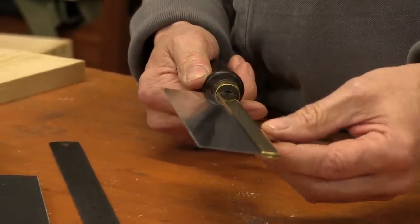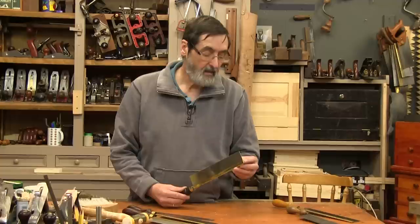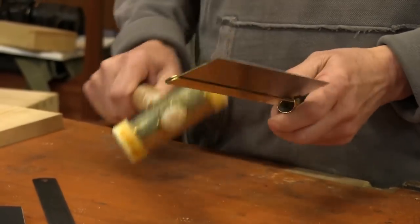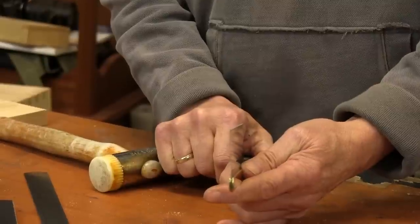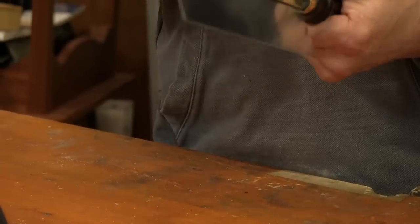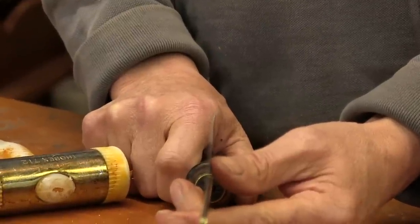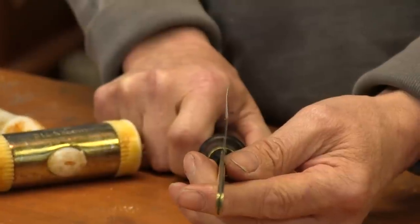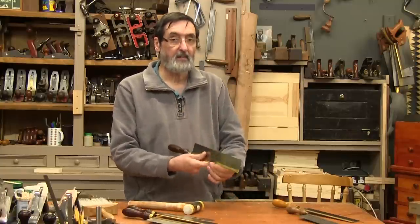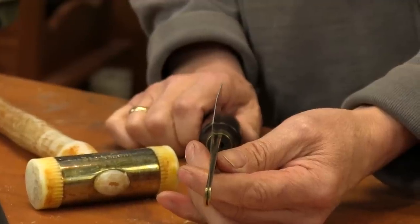This brass back is not milled from a solid brass piece. It's a folded piece of brass that was an inch wide, folded over to form a continuous U-shape. Watch what happens when I tap the back of this saw with a hammer. You agreed it was straight along its length — watch now. You can see it has a slight bend going down the length. I'll hit it again, and now you can see a much bigger bend in the face of the plate.